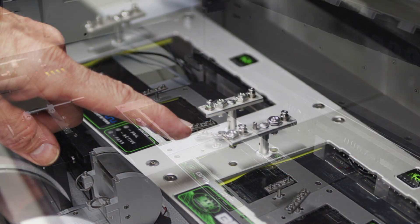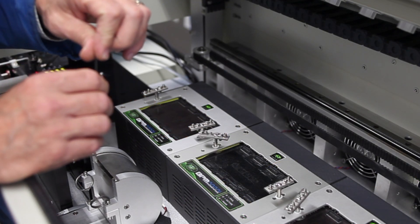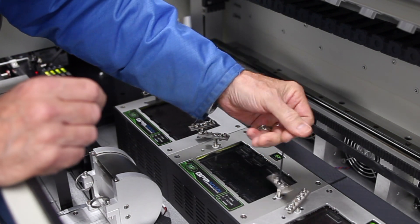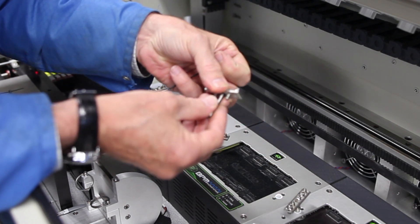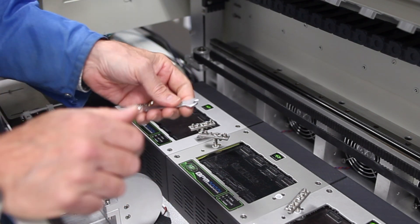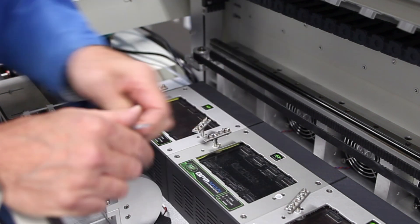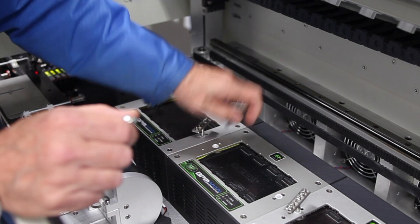The first thing to do is remove the T-posts. There's two ways to do this. The T-posts should be removable — lock-tighted in — but sometimes you can remove it with the top screw. If you cannot do that, or the screw starts to separate from the standoff, disassembling the whole T-posts, you can use a quarter inch wrench — one of which we supply with the machine on delivery — and just hit the flat spots on the standoff, and then you can remove the T-posts.